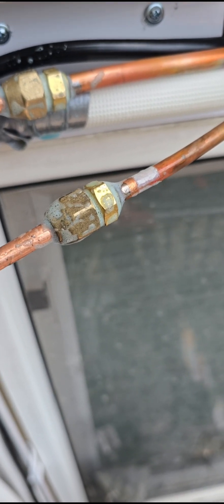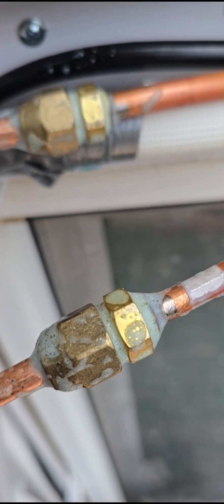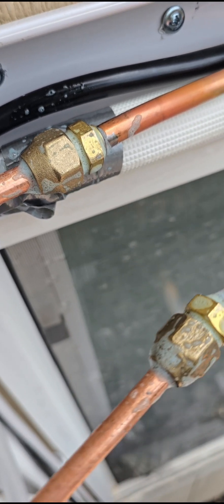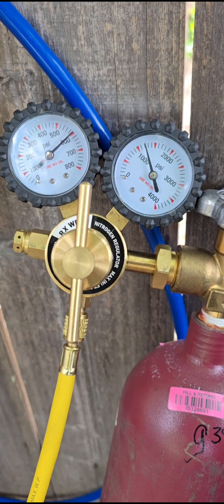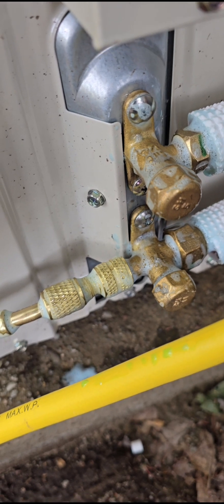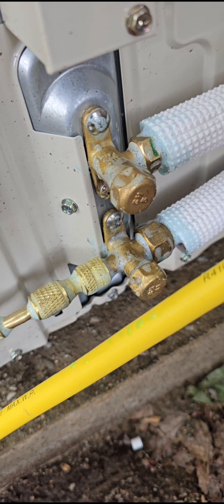I did these about half an hour ago. We're under 600 pounds of pressure and there's nothing leaking. That's what's nice about the Better Bubble product — it stays right where it's put through the entire testing procedure. If any gas were trying to escape between those seams, it's completely covered with suds so it would bubble up and you'd see it instantly. It's been an hour under 600 pounds of pressure and no problem at all. Every single seam is completely covered. I even put it on the hoses — everywhere. No leaks, everything's perfect, and we're going to go ahead and start our vacuum.